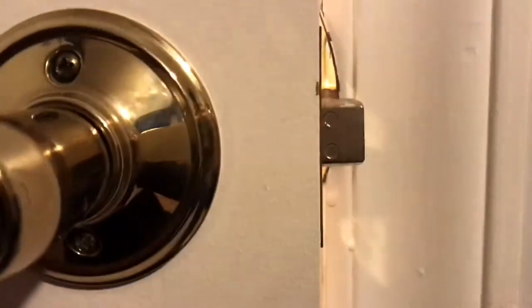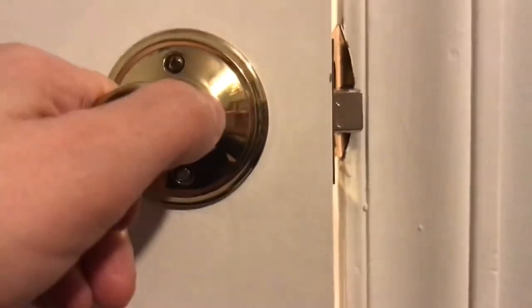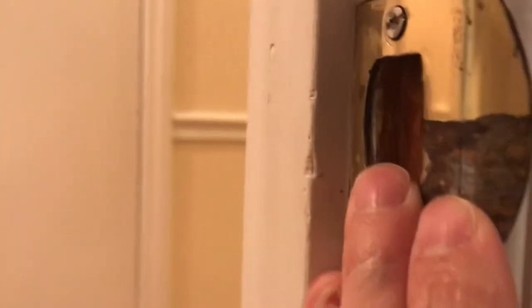You can just shut it and try to look right at that crack. This one I've already fixed — there it is, slides right into there, that's what you want. The part that was a little too low was not sliding in there. If you can't see it, just put a pencil mark right there so you can open it up and kind of see what's going on. This is your latch plate, your strike plate, your striker, your latch.